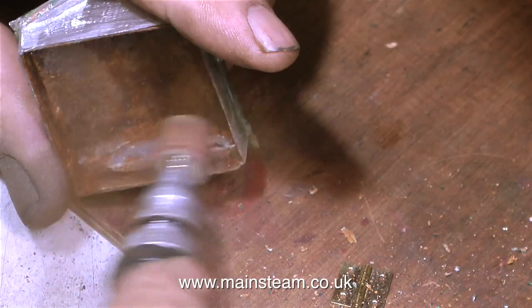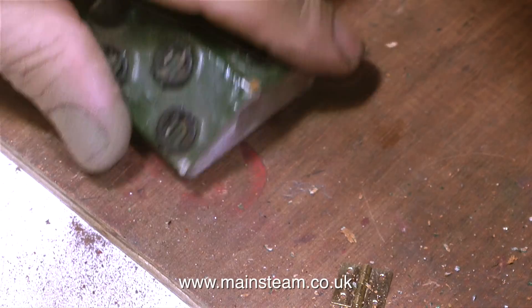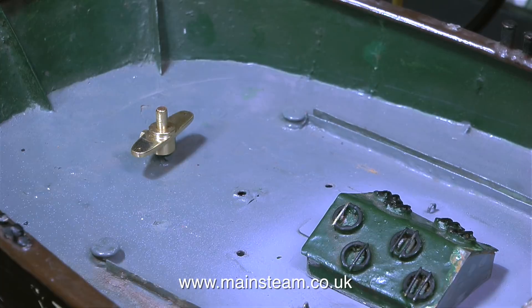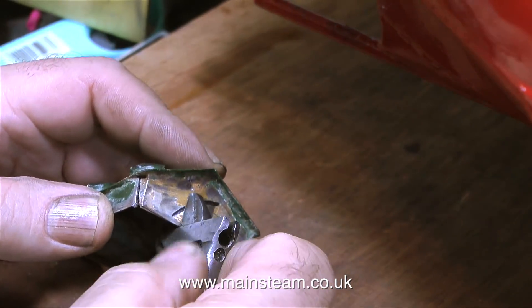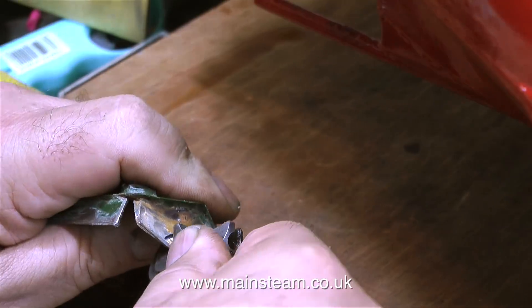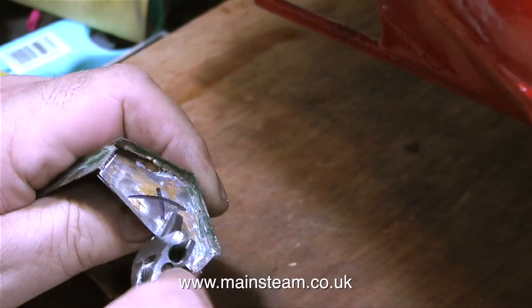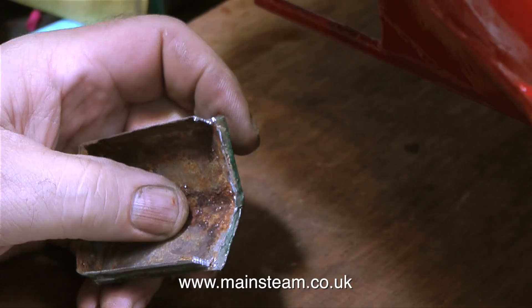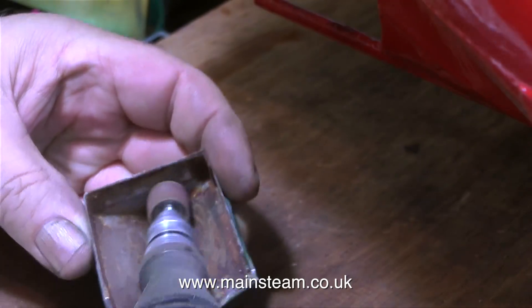When this part sits on the deck at the stern, it's quite visible, and it's also very rusty inside, so I'm using a small drum sander fitted to my mini-craft drill to clean it up. This is where the part fits on the deck, and I'm going to modify this so I can have a pushrod from the servo just inside it, coming out to operate the tiller arm. So I need to remove the metal from one side of this part. I cut down each side very carefully with the band saw, and here I'm using my small Berco spanner to lever the metal back and forth until the solder joint breaks. Now it looks like this — it still needs some more cleaning up, so it's back to the drum sander for a festival of rust removal.